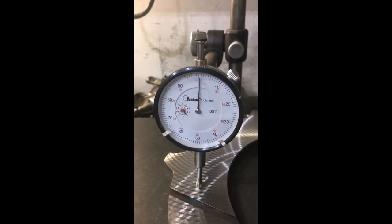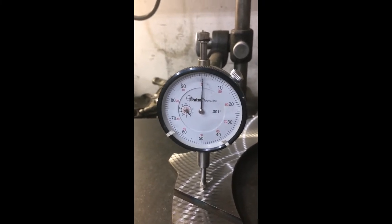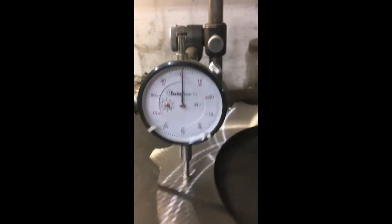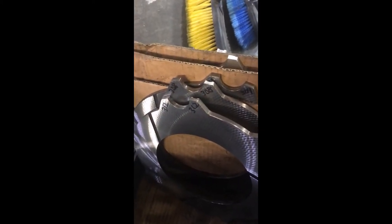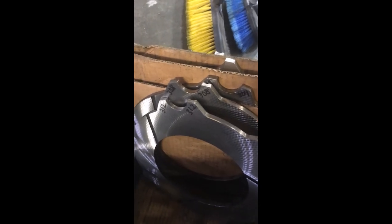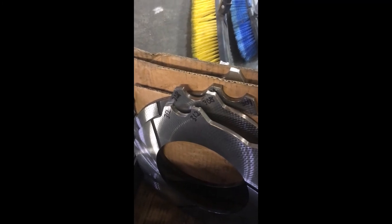I can't do this and hold the phone at the same time, but basically I just rotate it, make sure everything is within tolerance, and then I've already measured the thickness. We started out with 323. Now we've cut it down to 312. So I mark it and I put it in a tote here. Numbers up top, and then at the track, when the guys are putting together the clutch packs, all they have to do is go in, find the numbers, add up all the numbers, and make it the thickness,